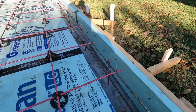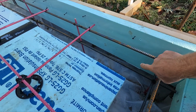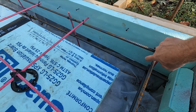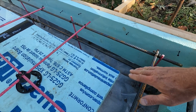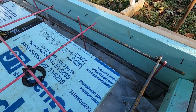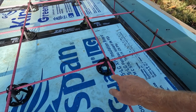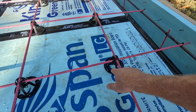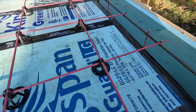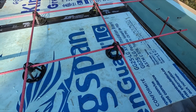One other detail I wanted to mention: it's going to be hard to see, but underneath here on the bottoms of all these insulation boards, I actually cut them at 45 degrees to allow the concrete to flow underneath to make the footer wider under the foam board. One thing that was nice about these plastic chairs is I just took some drywall screws and could push them in with my finger and pop in a couple just to hold those chairs in place. Still waiting on the concrete — the truck should be here in about 40 minutes.